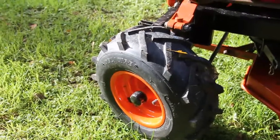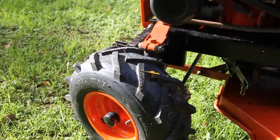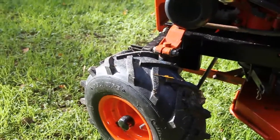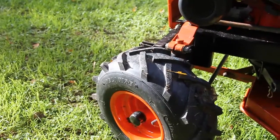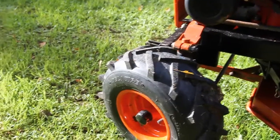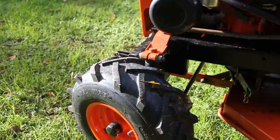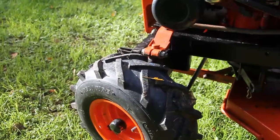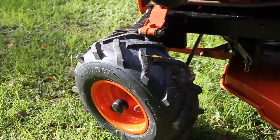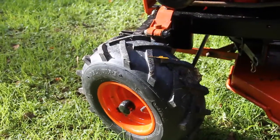The same applies for the front, although it's a bit different. Because they're quite small tyres and it's got the engine weight plus the snow plough weight on there — the snow plough itself is in the region of 30 to 50 kilograms, so it's not light — having all that weight with low tyre pressures is going to really wear those lugs down rapidly. So I'm going to have to let them down a bit, but I won't be able to let them as far down as I do with the rear ones, otherwise these are going to need replacing in only a couple of years when I could get five or six years, or maybe a lot more, out of them.